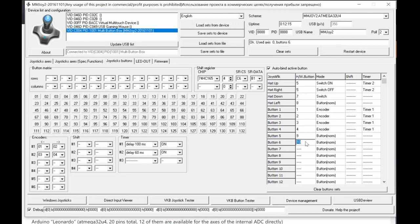So a single toggle switch in hardware creates two virtual buttons in software. Button 5 pulses when the toggle goes on; button 6 pulses when it goes off. This is extremely useful in simulators like DCS where the on and off states may require separate button bindings. In DCS, the on-setting comes from button 5 and the off-setting from button 6.